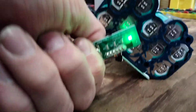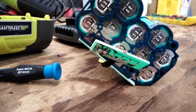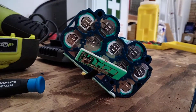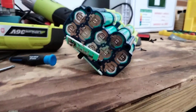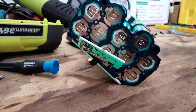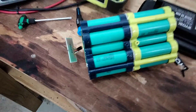We have a switch and it is potted, and it does turn on so there is a little bit of charge in this battery. These cells go through hell when they're being used — the tools draw a lot of current continuously for the entire useful life of the cell, and that means the cells get hot and degrade pretty quickly.